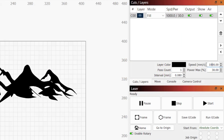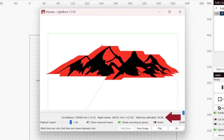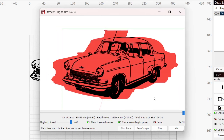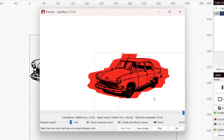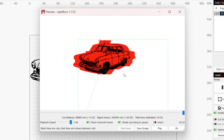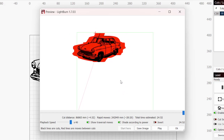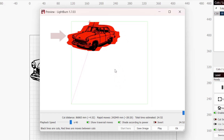If you adjust speeds for your engraving and check back in the preview window, it'll give you a good idea of what an optimal range is before you start to increase job times by traveling too quickly. The preview window also shows you the maximum boundaries of your laser's work area, depicted in green, which may require you to zoom out so that it's in view. It's a great way to check that your overscanning distance keeps the job within the bounds of the machine.